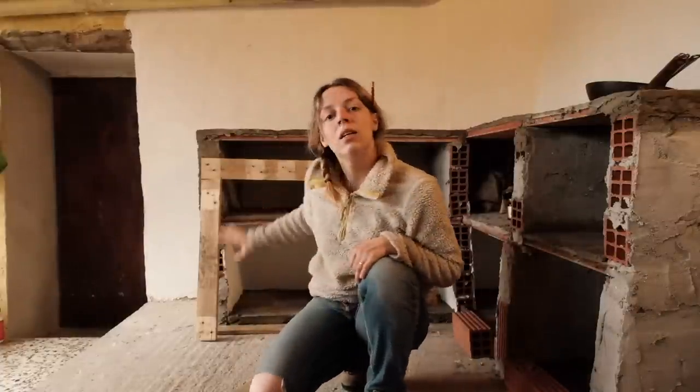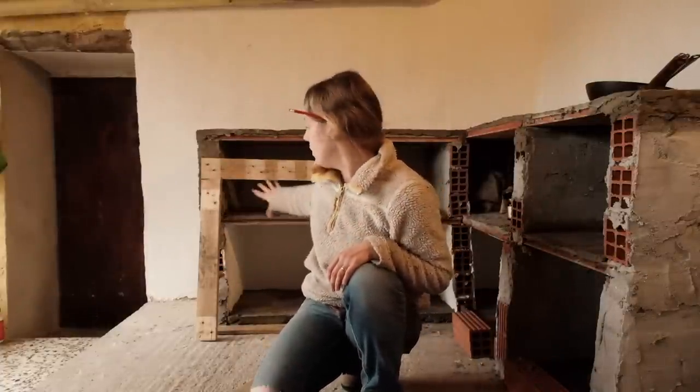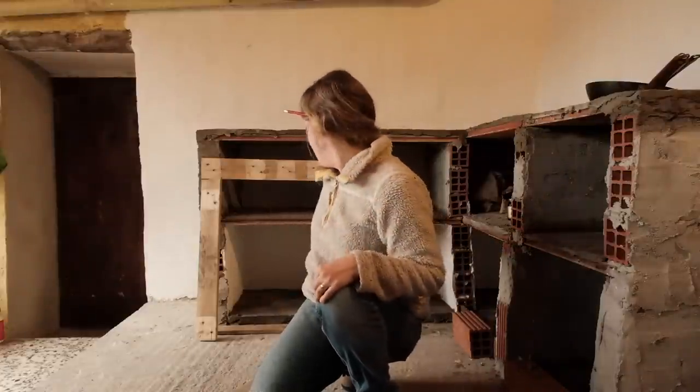I've got this wooden frame that I'm going to put on this section. I'm going to attach it onto the brick and the cement work, and any little gaps can be filled in with plaster later on, so it should look like a nice neat frame. And then the door goes on the frame. It's obviously much easier to screw into the wood. It'll form a nice clearly square frame for the door to go in.